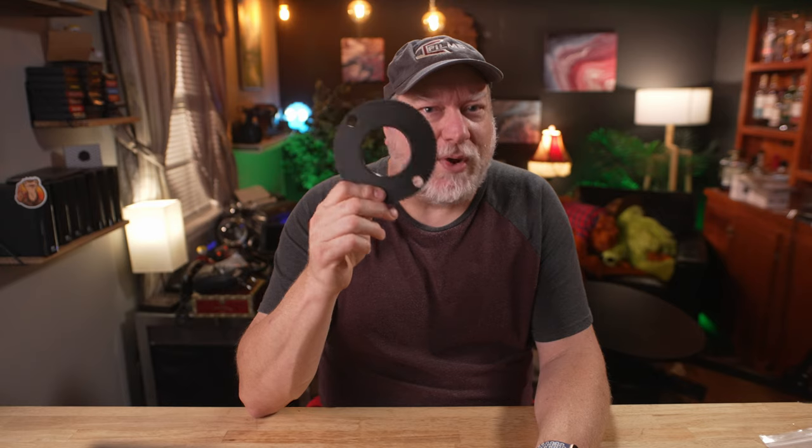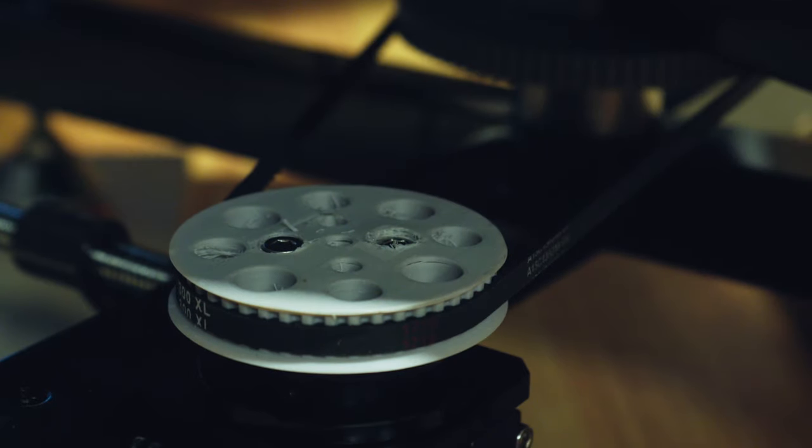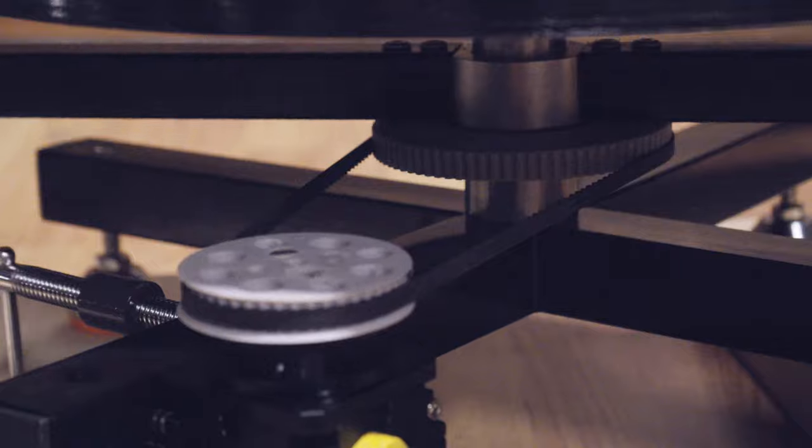But what if we take it to the next level? The system is a great building block to start from. A simple 3D printed gear pressed onto the Raube machined hub transforms this into something even more incredible. Honestly, I wonder if they had this in mind from the beginning because there's exactly enough room for a gear in there. I added the power block from Kessler to the base and used a 3D printed gear on top of that, and got an XL timing belt from Amazon. Now I have a powered orbital 360 rig.